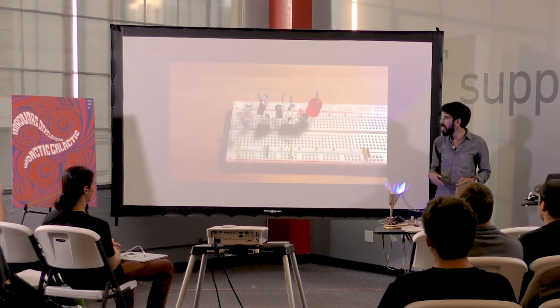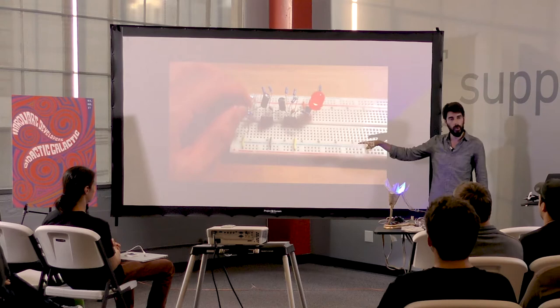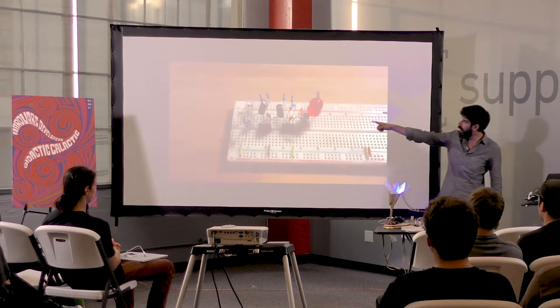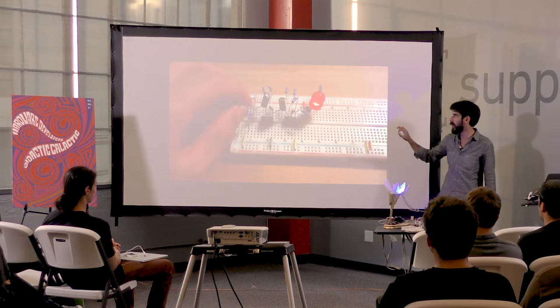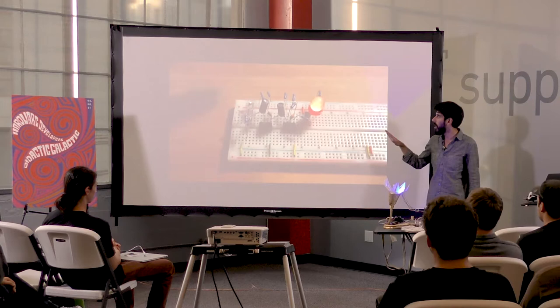Let's talk about the sensor. I went to Make Magazine to find out how to build a pulse sensor — it's all passive components, two op amps, about 10,000x amplification to bring up the pulse signal. It uses an IR light and an IR receiver. All standard components — capacitors, resistors, a couple op amps, a transistor, and an LED. It works very well for being entirely analog and inexpensive, but there's no way this was going to work out on the playa.